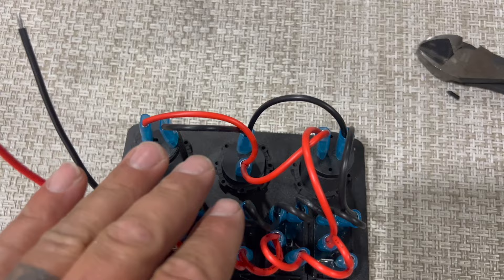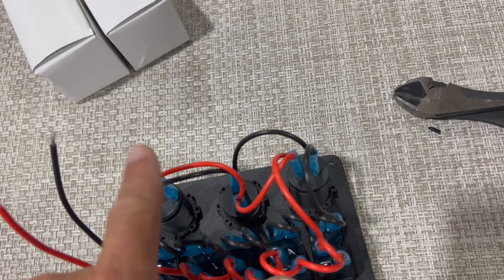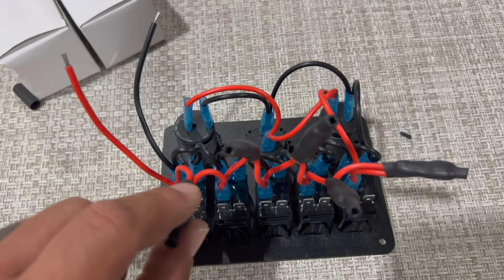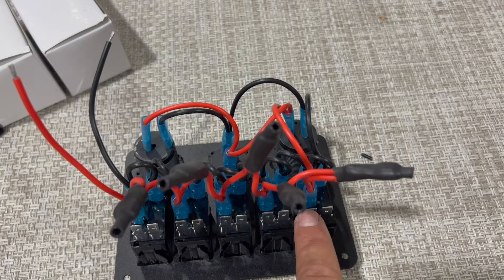So I'm going to snip this out. While we're in this last switch, the far right is going to be my charger, voltage gauge, and 12-volt. That's also going to power on my stereo. We'll stack a few things on there, but it'll get it all done, and that way when I turn all my switches off, everything is indeed off. I put a little shrink wrap on each of the wires that pulled off. So that constant light is off — it was this right-hand post. All of my accessories will now insert onto this post, which we'll do from the wiring harness from pontoonstuff.com.